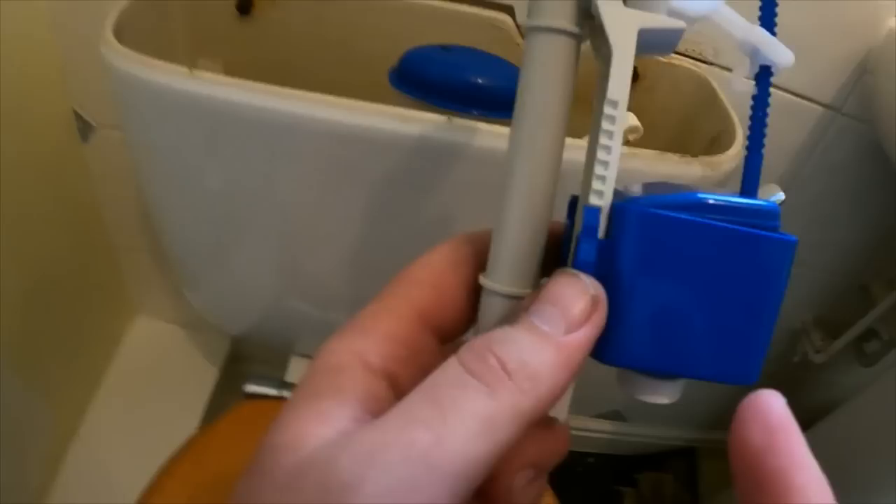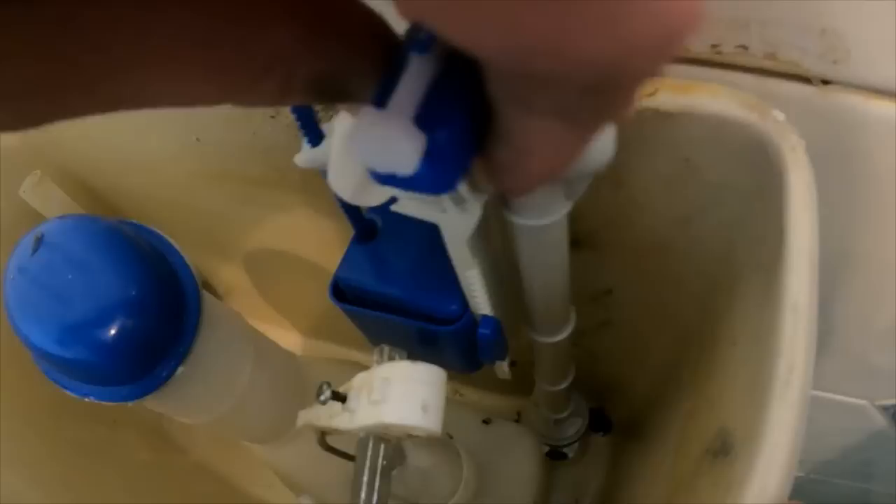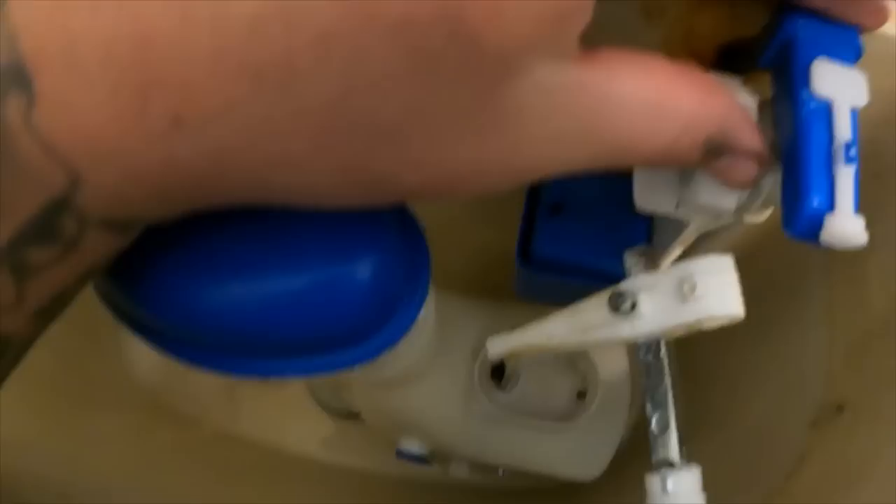Look, you can see just how the edge of it was pushing against the bottom of that siphon. We'll give that a clean up and hopefully we can get the Dudley one in the same way as that one came out. I think we're going to get the bottom of that Dudley one in - because it's just not quite as bulbous as what the bottom of that one is. I think we'll just be able to get that in and slide it underneath that siphon. As always with these Thomas Dudley ones, you can just alter the height there, then screw out your float to exactly where you need it. That's going to sit in perfectly - the float's been adjusted, sitting just on top of that siphon, and the brass body sits there perfectly. We'll get a nut on the bottom, get it all tightened in.